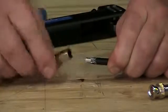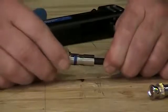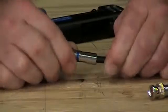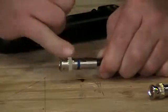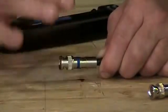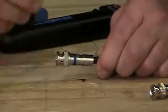When I insert the connector over it, the inner barrel inside of here — when I insert this over the dielectric and this foil — I might give it a little bit of a twist like this, which will help ensure that it slips over the dielectric and that foil. And I'm going to push it on until it hits my thumb. I know I've inserted that connector all the way in, and the center conductor can only go so far inside the pin, so it can only be pushed on so far.